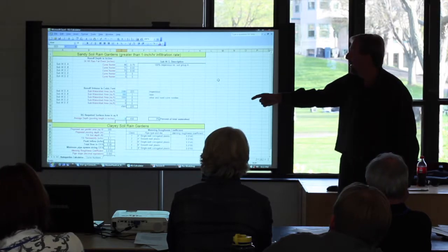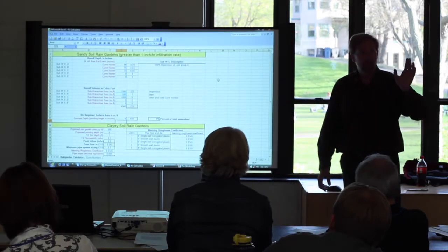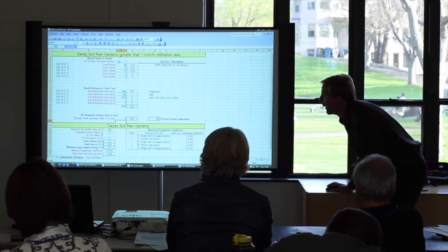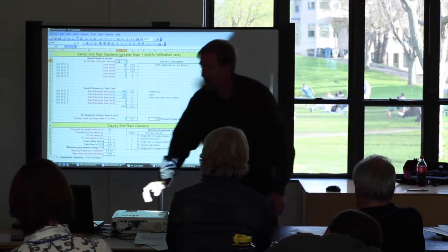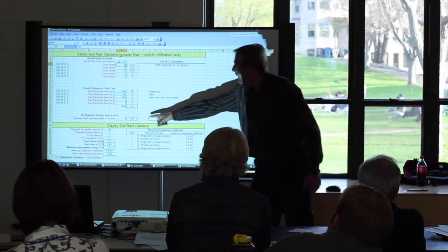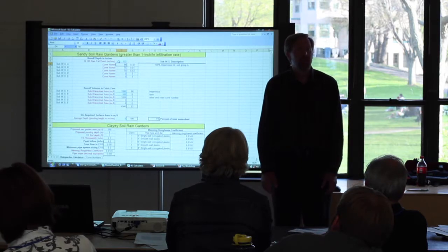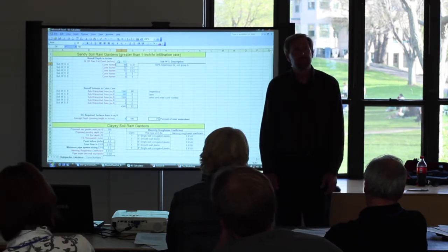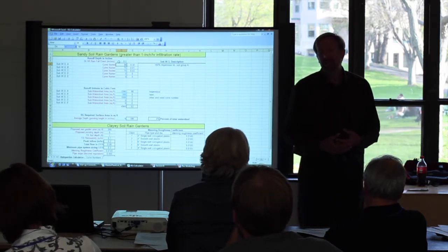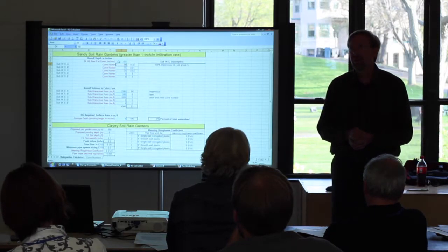And then you can go backwards in this also to see how much water that does capture. Let's say you can only make 200 square feet because that's all the space you have. Then you change this number up here to see how much water you actually do capture. Let's say it's 0.5 first. 186, look at that. It's about 0.5, 0.6, 0.55. So a half an inch of water that you're going to capture, okay? So play with this. It's somewhat intuitive, and it's really just a tool to get you in the ballpark.